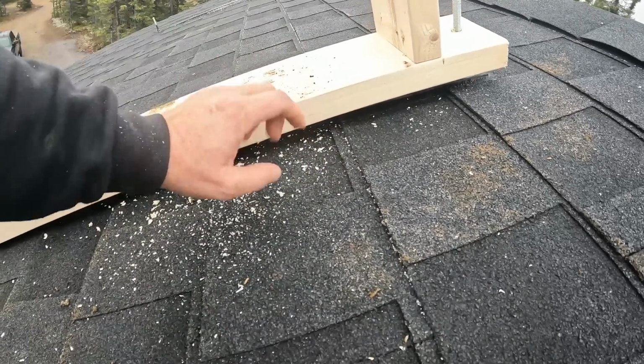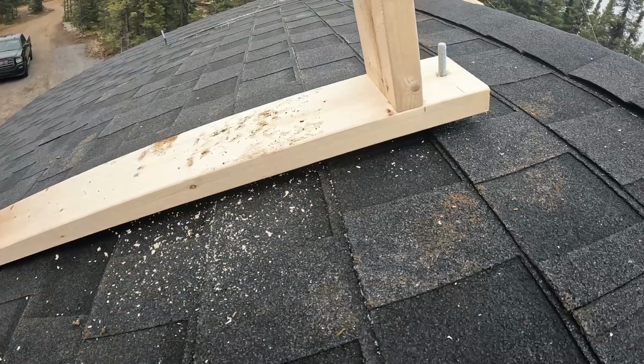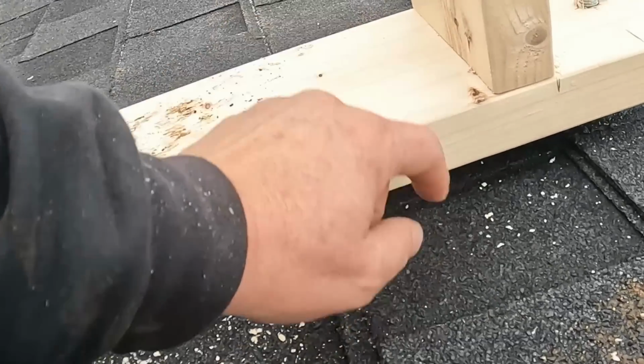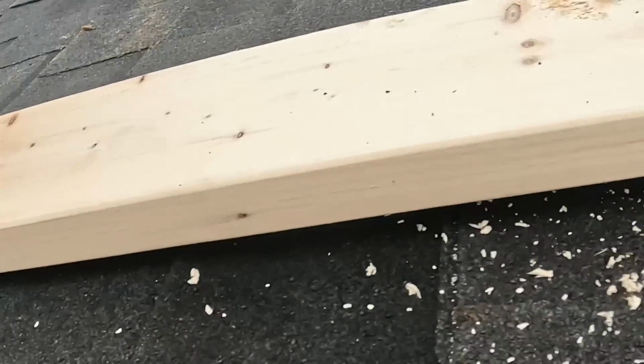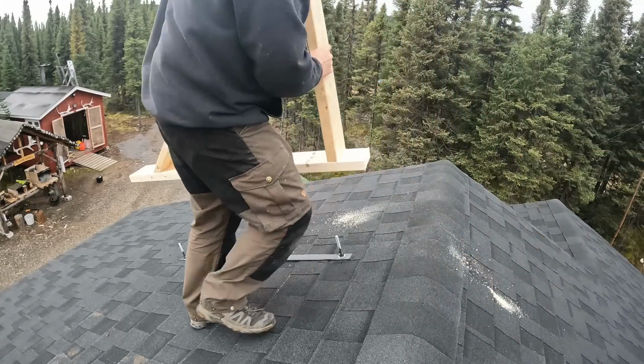And I put that metal down there and I wanted this wood to be raised. I didn't want this to be touching the shingles at all, and then lots of water building up there, and that would lead to rot. So as it stands right now, there's just the metal touching the roof and the water can run all beneath it. And I may replace this all with metal one day,